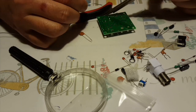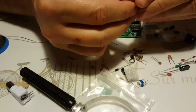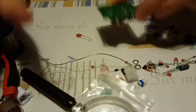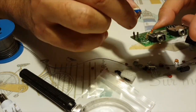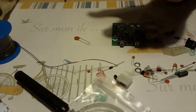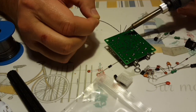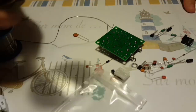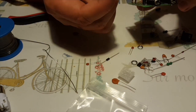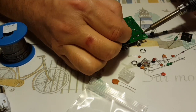Let's compare this to the Rock Mite, another kit I really like. The Rock Mite is also a crystal-controlled transceiver and is really better than the Pixie. Some people call the Pixie dismal or a really bad kit, but I don't think so — it works pretty well. It doesn't have any filtering, but neither does the Rock Mite. The Rock Mite does have a keyer, about the same power, and is a more sophisticated and sensitive receiver. But the Pixie is less than one-twelfth the price of a Rock Mite.